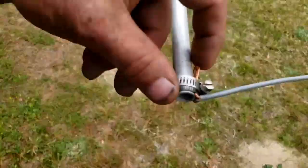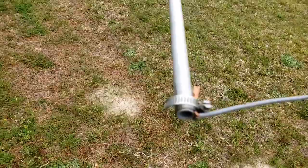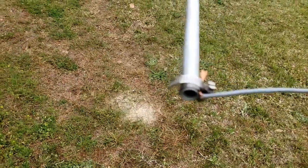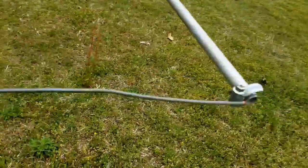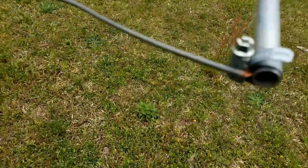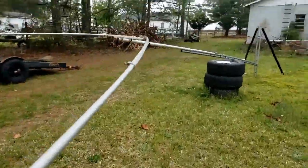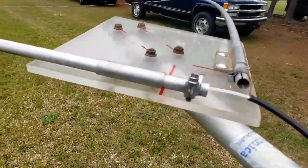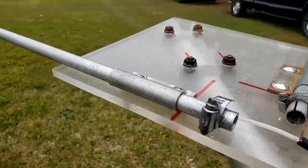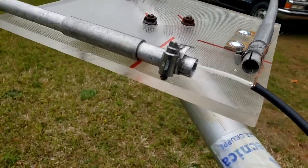It's not a permanent setup, so the copper against aluminum isn't going to affect me because this antenna won't be in the air long enough. We just want to see how good a delta loop works. You can see it's just clamped on. If it were going to be a permanent antenna there's a lot of things I would change, but I'm only doing this for experimenting.